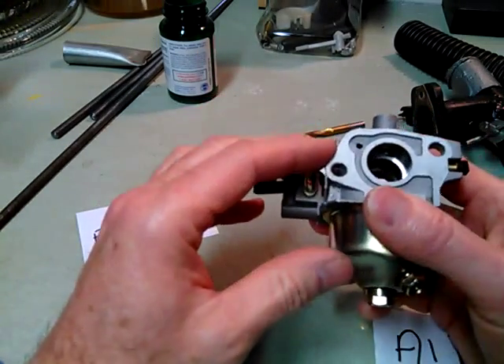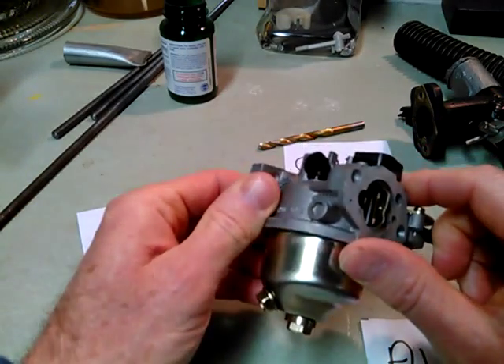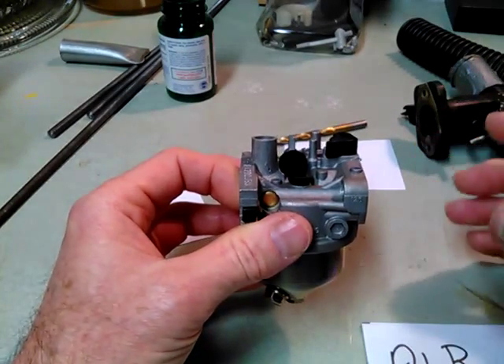One of the disadvantages is they're kind of choked down, so your volumetric efficiency might be a little lower. And you have to have another air cleaner, and of course more valves in the T.